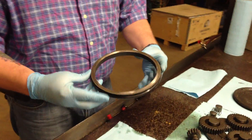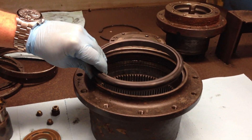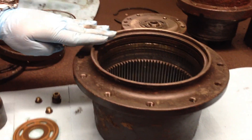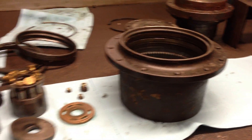I wanted to go over what that common problem is. That's this seal right here — this is known as a floating face seal. This seal sits like this against this hub, and that's all that holds the bearing oil in the front of your drive. So if you have a leak from this general area behind the sprocket — that's where the sprocket would be — this is probably your culprit.